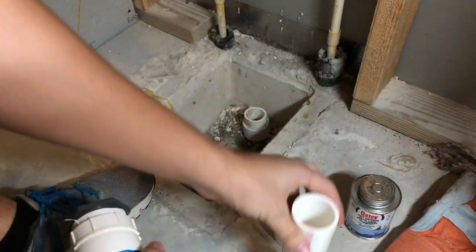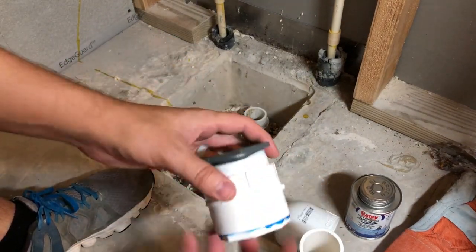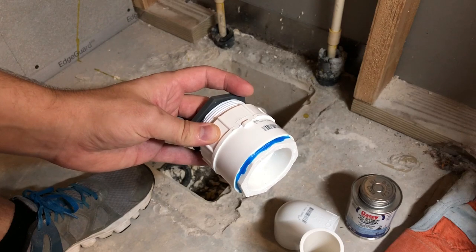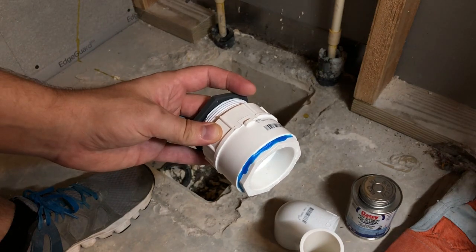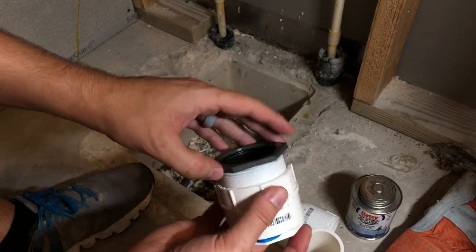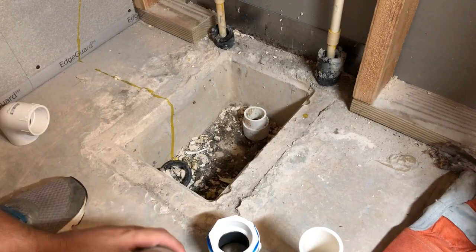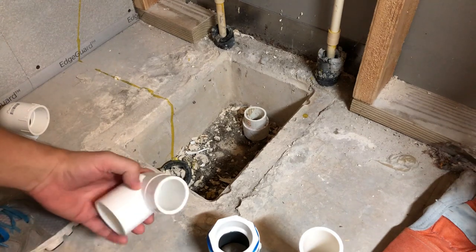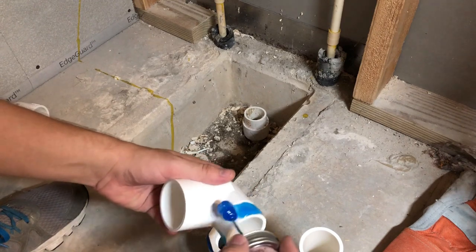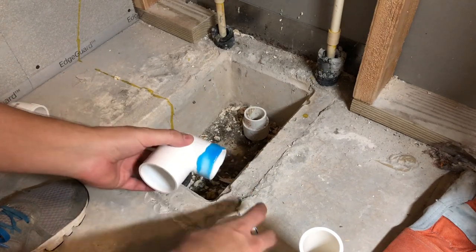The very first thing I did was dry run everything and make sure I was fine with the way it looked before starting the gluing process. I took the gray piece from the drain and found appropriate fittings to convert it to where it gives me the lowest profile possible. I used a pipe-by-socket 90 so I don't have to have actual pipe in between, which helps keep the fitting and the drain low profile, closer to the ground.